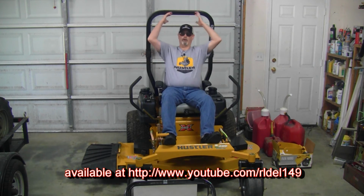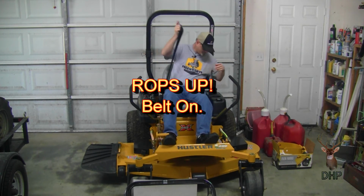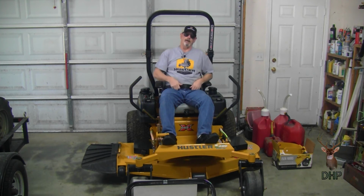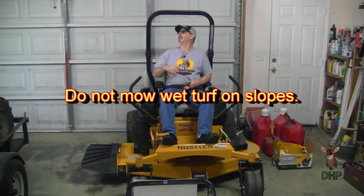Work with your ROPS, your rollover protective structure, and you got to work with your seat belt in place, because this won't do you any good if you're not belted in. Now, hopefully you're not going to flip over, and the mower you selected has a fairly low center of gravity, and it weighs enough. Some of these mowers I was looking at vary between 900 and about 1,200 pounds, and that extra weight helps keep everything down. But some of them, and you want to look at that when you decide, have an awfully high center of gravity. But this dude right here will do you absolutely no good if you're not belted in when the thing flips over. It will do you no good if it's not erect in the up position.